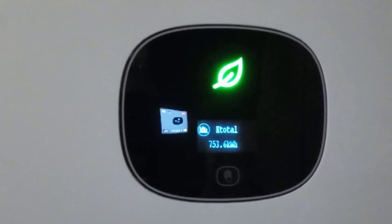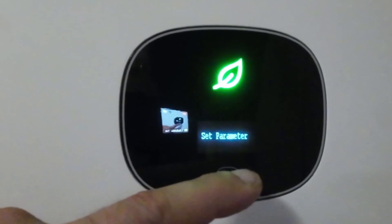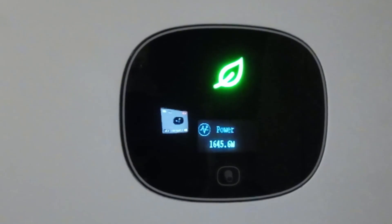It may be split where the best four months is two months at the end of next billing and then two months after. Right now we're pretty happy with 753 kilowatt hours because the savings is pretty good considering our rates just went up. My split system in series is not optimized — that is not ideal — space is a factor and you've got to work around it. When you're doing series, you really want all your panels on the same plane and not shaded.